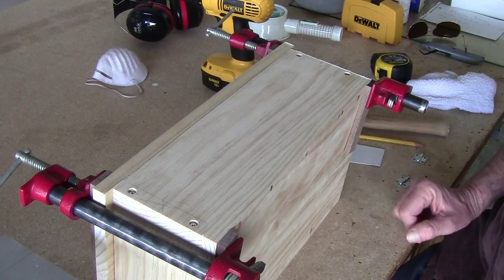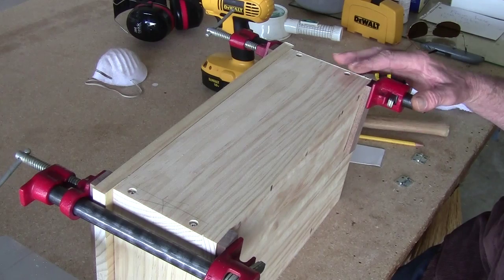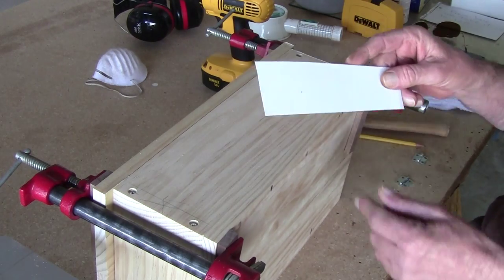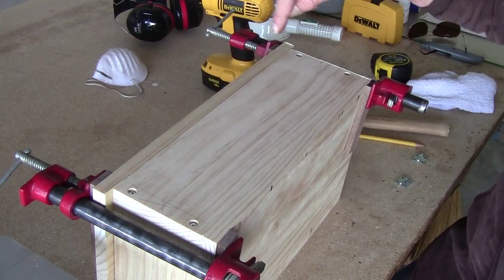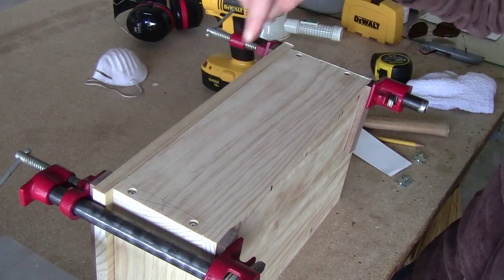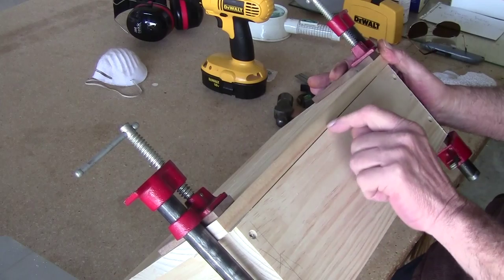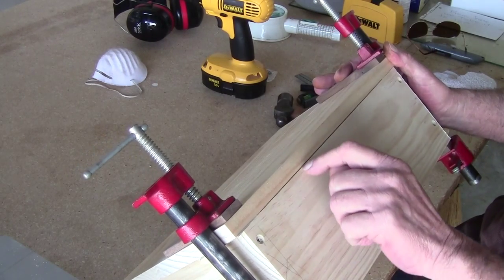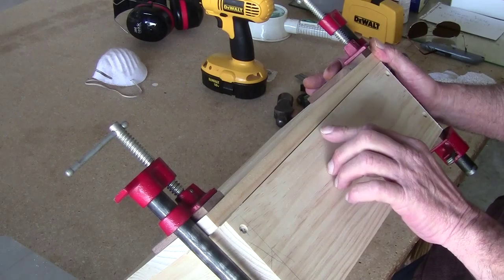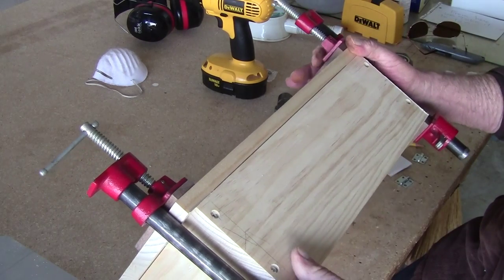Set up to put the hinges on - this gets a little tricky, if you do it wrong it can cause a disaster with the lid. What I did was take a shoe box, cut out little pieces, put a piece under here and under here so it's flat. I also made sure this overhang is a half inch on each side, then clamped it. There's a little space in here - you have to have that space because when you lacquer it'll swell up a little, and you don't want it hitting here before the front hits, otherwise the lid stays up.